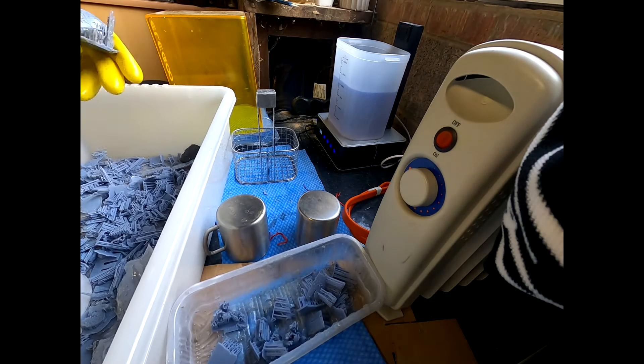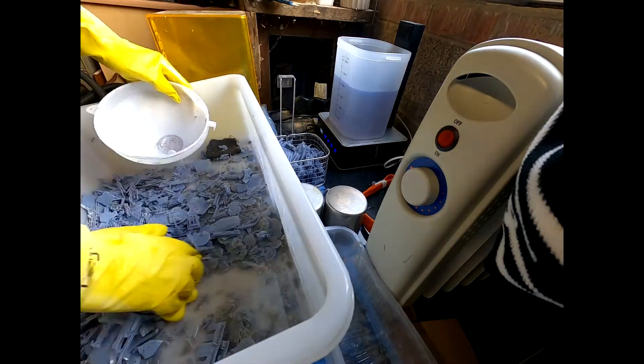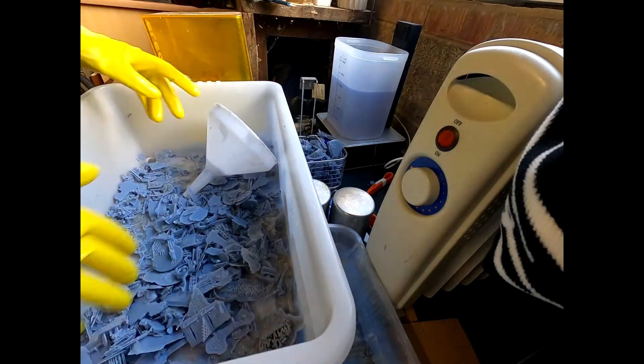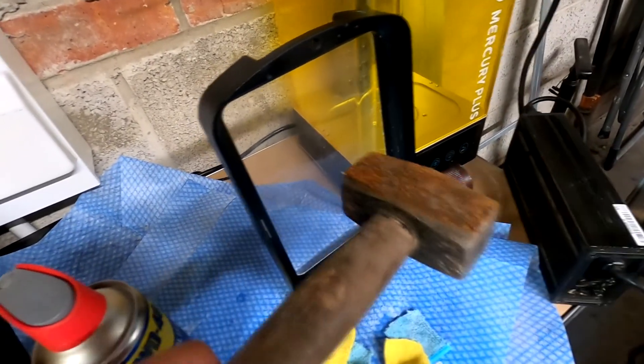Now this video might have said five points, but I'm dyslexic — so point number six: tightness of the FEP in the vat. Something I found with mine is if you just tighten it as tight as it will go on the vat, that is the correct tightness. I have a Photon Mono X, so if you have the same model, chances are that will probably work for you too. Another method is to get a spectrometer app on your phone, then hit the vat with a very light item that isn't going to dent it, and that will tell you the frequency — from there you can adjust. The frequency you want may vary, but for mine it's about 320–350Hz.